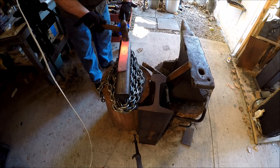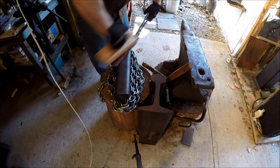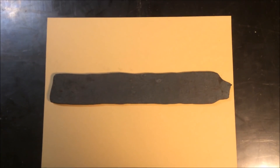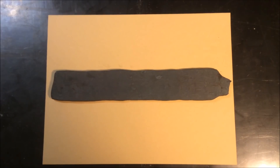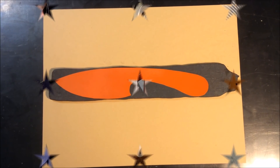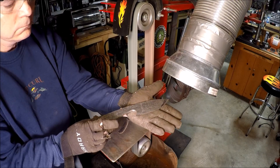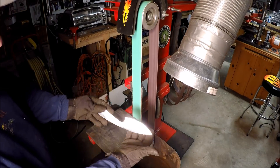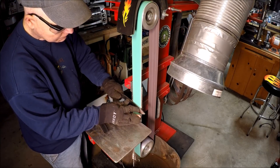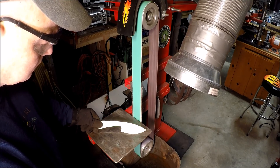We put some finishing touches on, made sure it was all straight and true. We cleaned it up and ended up with a good billet about 11 inches long, two inches wide, and about 3/16-inch thick — plenty enough for a skinner knife. There's the template for the skinner blade. We cut the blank out from the billet and here we are at the grinder, cleaning it up and taking off all the forge markings. I was at it for about an hour, grinding away through different grits. Turned out pretty good.